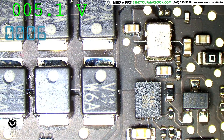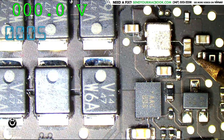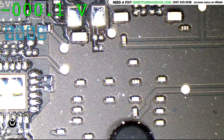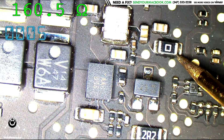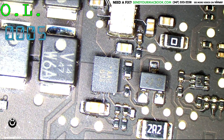Enable is present at 5 volts, but we're only getting 1.8 volts on the output. Let's see what our resistance to ground is on that rail — let's see why we're only getting 1.8 instead of 3.3. 160 ohms. That's not right. We have a short circuit, ladies and gentlemen.